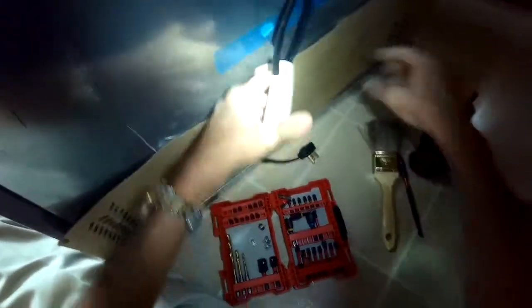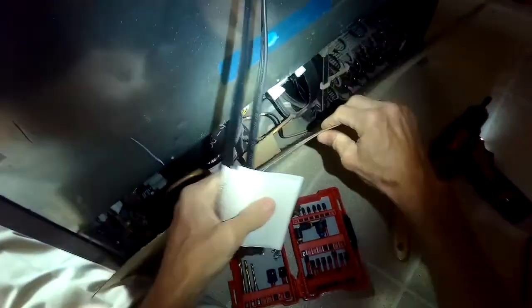And some of these refrigerators have a grill right in this area that you can clean, and some have it on the back. This one, it's on the back, so we're going to unplug it and we're going to remove some screws that are holding on this cardboard covering. Sometimes these coverings are made of sheet metal, sometimes they're made of cardboard. Pretty easy to just zip off the screws that hold it. These are 1/4 inch screws.